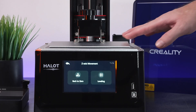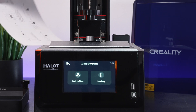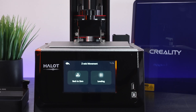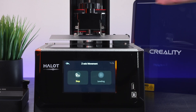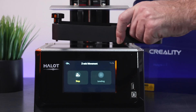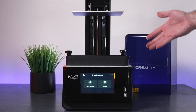Snug all four bolts up and that basically sets the level on the build plate. The paper comes out quite easily and you should have a nice even gap all around. If you don't think you're level yet, redo this and gauge your corners — make sure they feel about the same. Then go back to zero, which takes it all the way up to the top, and we'll install our tub back in, which clicks in quite easily. That's it — we are done with our level.